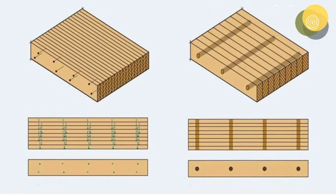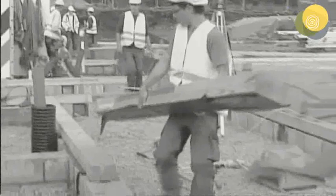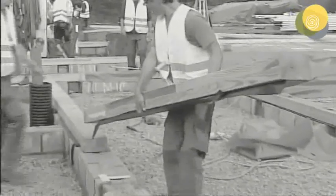That wasn't particularly successful as holes drilled through it hit the nails. So the next development was to change the nails into dowels. Cutting through the dowels was simpler and produced a very efficient system. A further improvement was to put the dowels in diagonally, which makes the overall panel very rigid because it stops the individual planks from opening up.